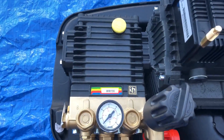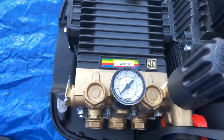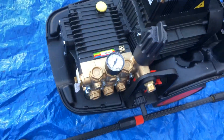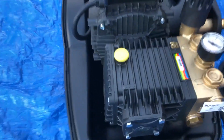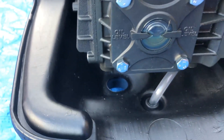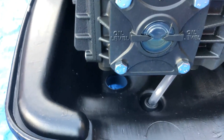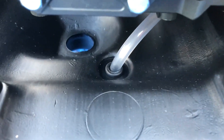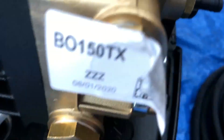And you'll come to the W156 Interpump. On here you've got the oil sight glass which is visible and easy to check. You can actually check it with the cover on as well, but you'll see the oil is halfway up. And you'll also see there — that's the chemical intake pipe. That goes into the back of the system to control the soap, so that's sucking out of the tank itself at that point.